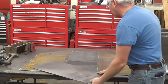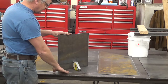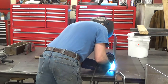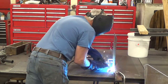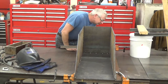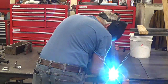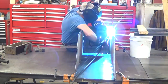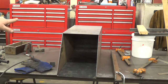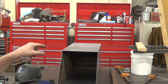I've gotten all of the pieces cut now for my mine cart. I've got them all cleaned up and trimmed. I'll go ahead and weld this together. I'll use some magnets to help get everything lined up in the exact location. I'm thinking about putting some angle iron on top so I can bolt the lid off and on — just quarter-inch bolts. I'll find a piece of angle iron to go all the way around there.